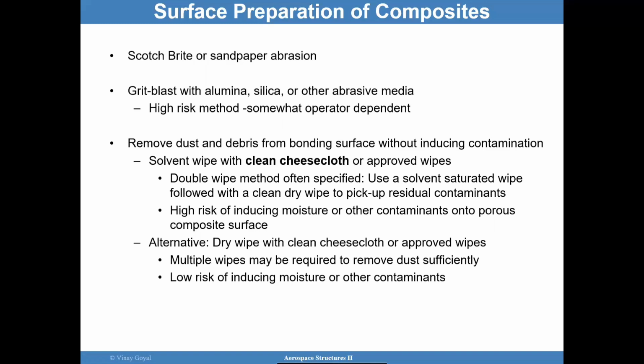the dust particles have been removed. And the thing I want to point out here is that if I ask manufacturer A to design a joint and manufacturer B to design a joint, and I ask two people to go and put those joints together, but they're different people with different training, I suspect that the two failure loads you will get from the two different designs or the manufacturing that came out are going to be different. Okay, so it's important that whatever method you're using, you're consistent throughout your qualification program, because the surface preparation technique you use today is going to impact later on what you do. So if you're going to later change your surface preparation technique, come back, requalify, and make sure that you haven't changed the strength capability because of something you changed in your processes.